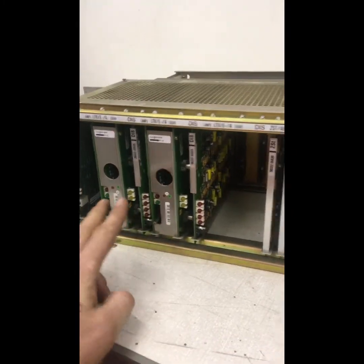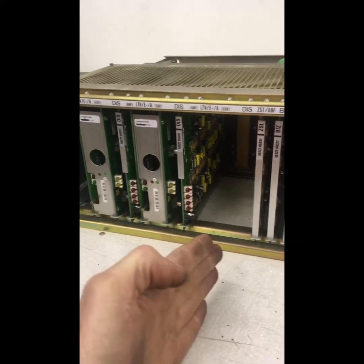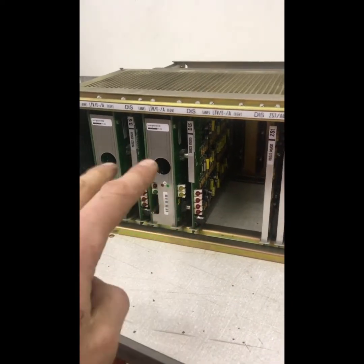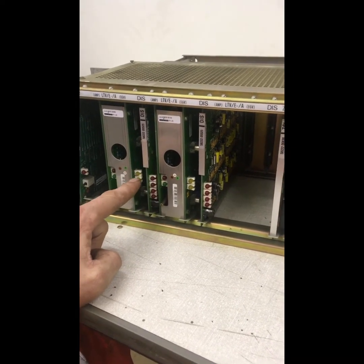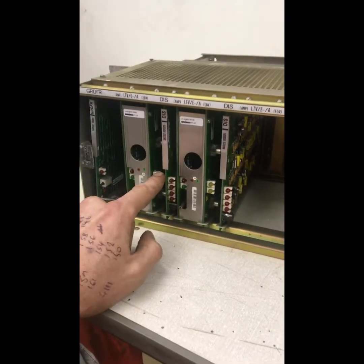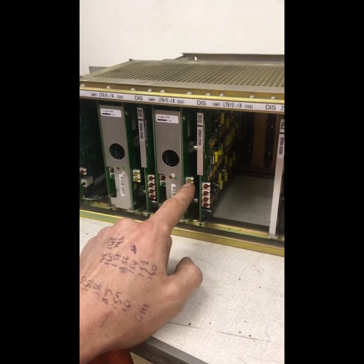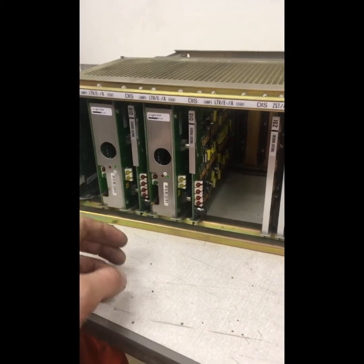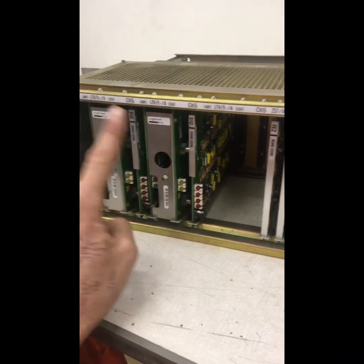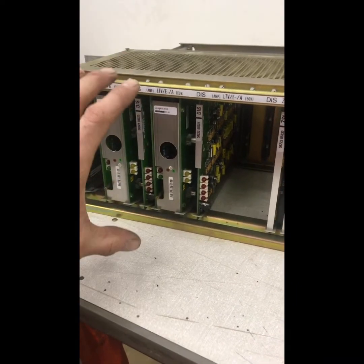As the train passes through the count heads SK1 and SK2, it will operate these LEDs so you can actually see the motion — it is very quick, though. Likewise, the count-out heads SK1 and SK2 will also operate on these, checking the frequencies and voltages coming from the evaluator mushrooms on the ground to confirm everything is correct.